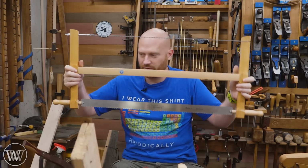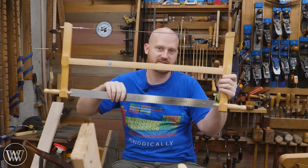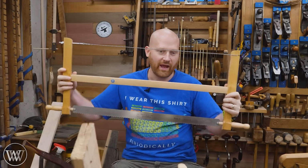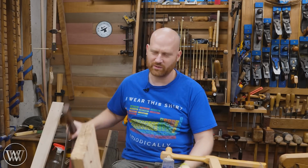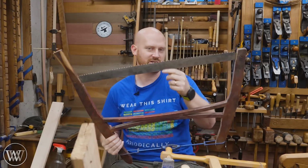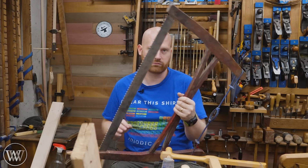In continental Europe, you'll find a lot of joinery saws that have many different shapes and sizes, different teeth. You'll find some with crosscut, some with rip cut, different sizes, different lengths, and you can do all of your joinery with a collection of bow saws. Whereas in the Americas, the only place you commonly see them are the buck saw. This blade does not turn. It is only crosscut. It's designed for bucking logs. It cuts the logs into shorter logs.